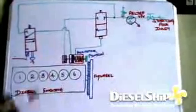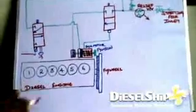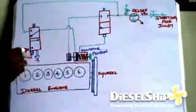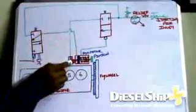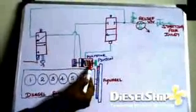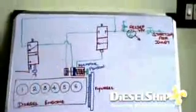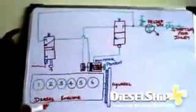And as the engine picks up speed and starts combustion, let's say at 30 or 40 RPM depending on the engine design, let's say it fires on fuel now. A signal from the governor or from the control system, depending on the design, comes and deactivates the solenoid valve. Once it gets deactivated, the valve gets shifted again and the air behind the piston gets drained. So the piston, due to the spring force, retracts, thus the pinion is withdrawn from the flywheel and the air supply is shut off, which means the air to the vane or the air motor is cut off in this place. Now this is the engine in, let's say, idle position. The engine is not started now.